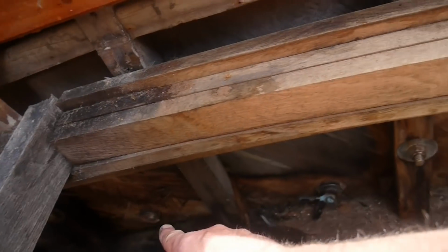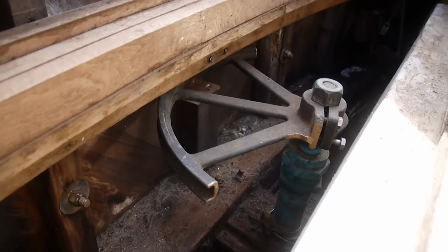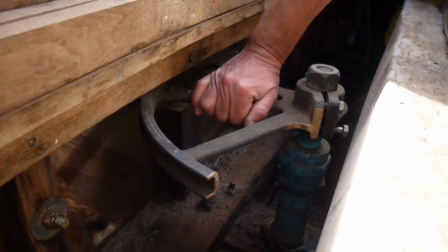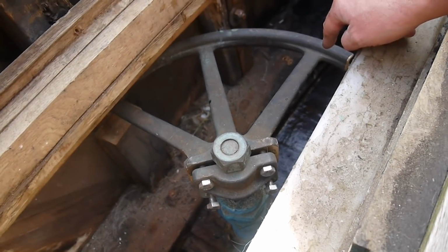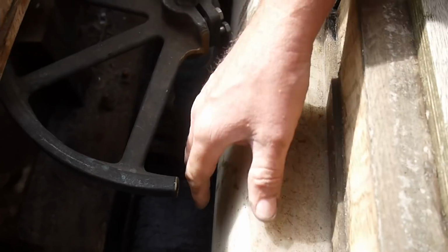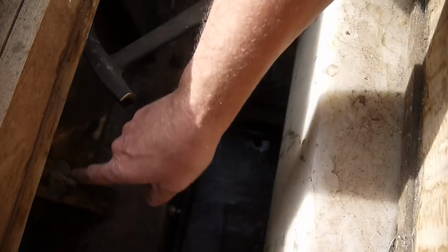So the point is, the stainless steel cable will come along here through a sheave and then ride in the groove on this quadrant. Now if you look at this quadrant, it only has a single groove. Some have two grooves which keep the two wires separate, but more on that later. Anyway, so it will rotate 90 degrees, so it's 45 in one direction and 45 in the other. For those of you who are concerned that I need some bump stops, end stops, I definitely do, and I'll arrange something here. In fact, this will probably be trimmed off a little less in time. Okay, so that's the quadrant and how the cable is going to ride on it.